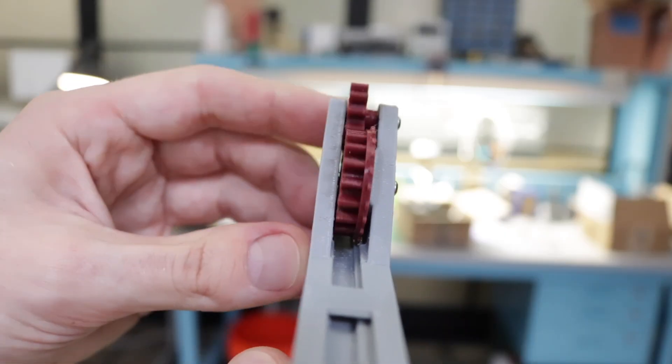This one is starting to get close, where I actually put a bar on either side of the gears so they were held straight. It was still a bit of a tight interface between the gears — it wasn't letting the film slide through when necessary. Also, the pathway for the tape to go through is much bigger and there's a ton less resistance, so it's much easier for it to actually be pulled through. And then the second-to-last one, I made the interface even bigger so these rotate really easily and totally let film slide through, but still give enough friction to peel it back. Everything's in PETG now, and I find that the surface of PETG allows a little bit more slippage of the film, making it even easier to pull the tape through.